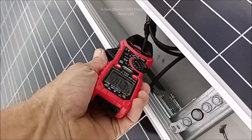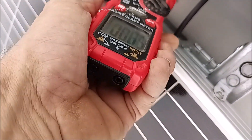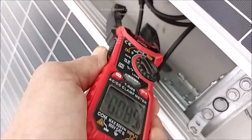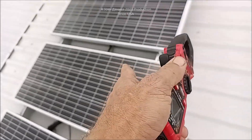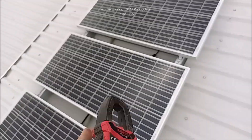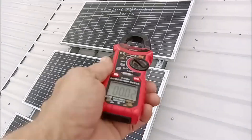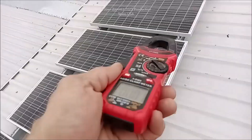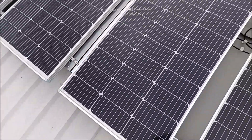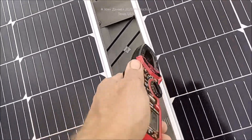This is the wrap-up in the evening. Now what happens if I come up here and I've got 0.85 or 4.7 amps here and 4.7 and 4.7, and then over here I've got 0.02? Bad panel. Did I have to disconnect anything at all to determine that? No — I did not have to disconnect anything to do that.